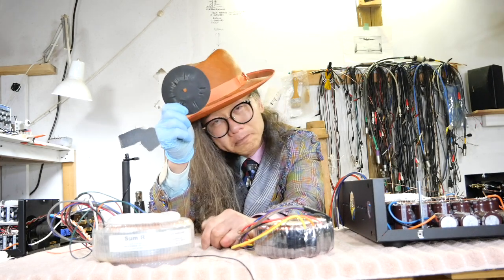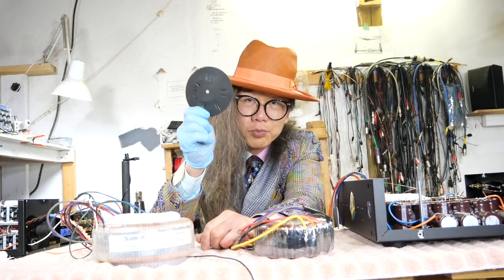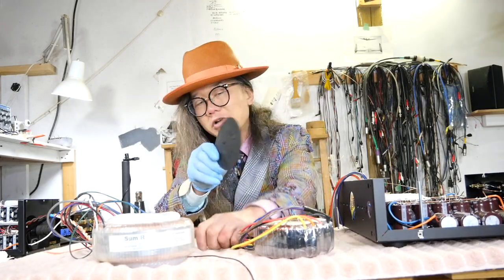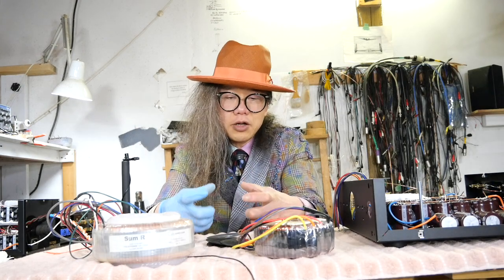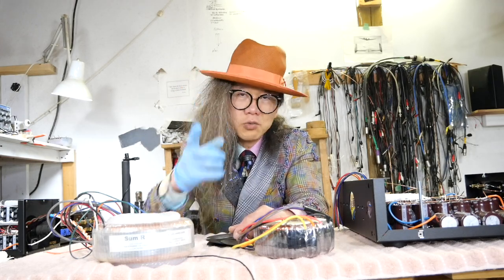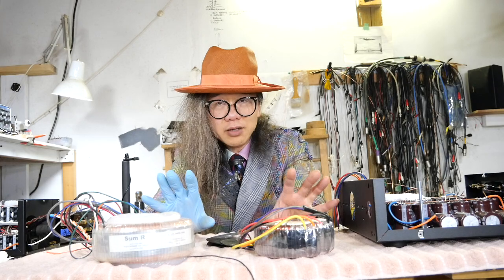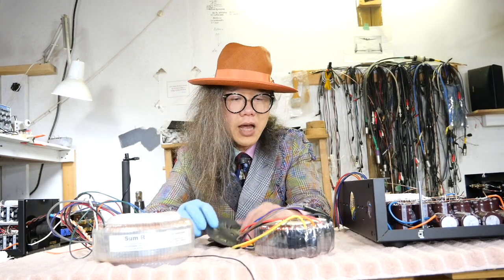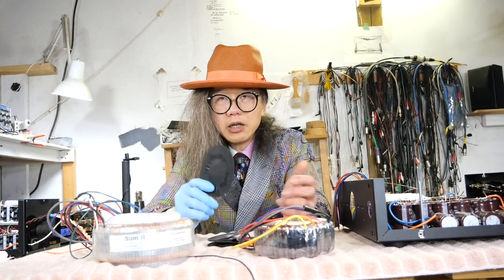You don't even know if your amp that has a toroid actually has a broken rubber washer until you take the transformer out. There are transformers that are actually poured in a round plastic container with resin — and they still use a single bolt to bolt it down, which is perfectly fine. But there are many, many more that are just using a rubber washer and a bolt.